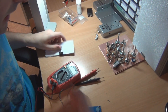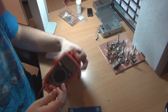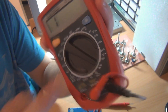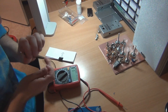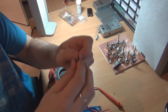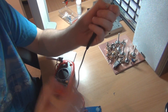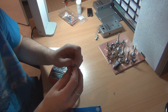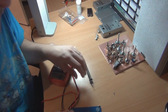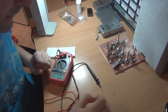As you can see, those two are twisted together and that one's on its own — that's your diode. To test which way around the polarity is, just get your multimeter and put it into diode mode, which is that symbol there. For this one, the negative goes on the two legs and the positive goes onto the emitter on its own, and I get a reading. That's the way this one goes for a PNP transistor. NPN might be different — you'll have to test that.